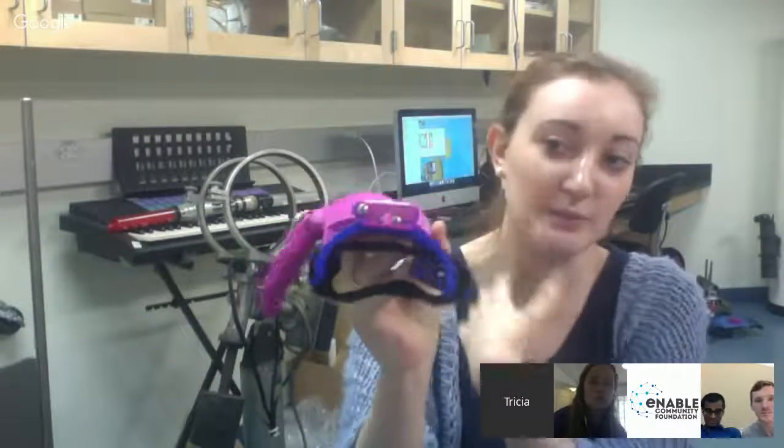We took a bunch of our hands to the Maker Faire, so we saw a lot of different versions being used and a lot of different things being done with the hands. It was a good time to see general weaknesses. The adaptive grip was really helpful, and some people had preferences. Our Frozen themed hand has that whipple tree inside, and it's hard to see, but it's in there. The tensioner clip is a bit different, and this seemed to be the hand that did the best and had the smoothest grip. So I'm glad it was suggested to print and test a whipple tree. We are getting on that, and we'll be including it in some of our designs.